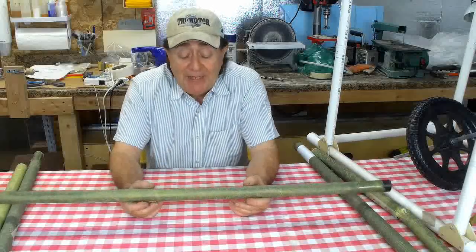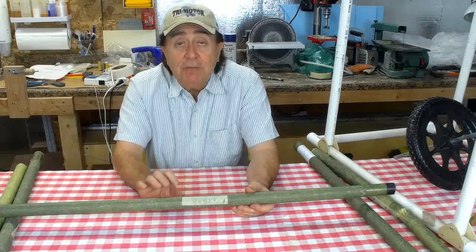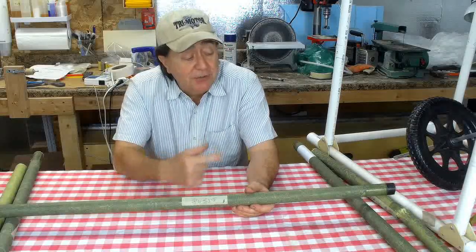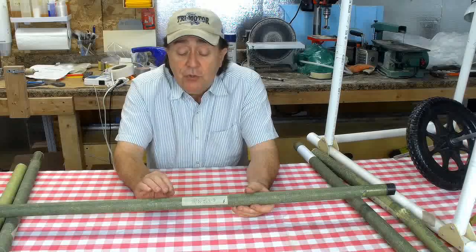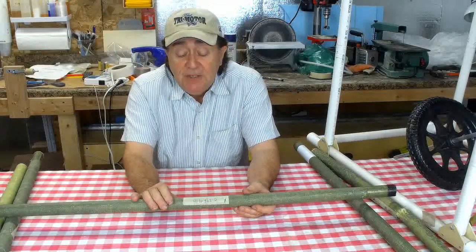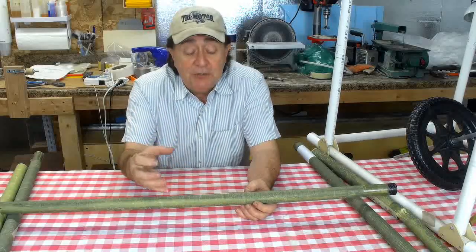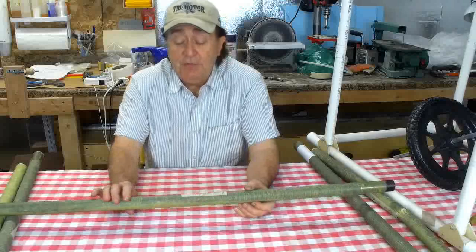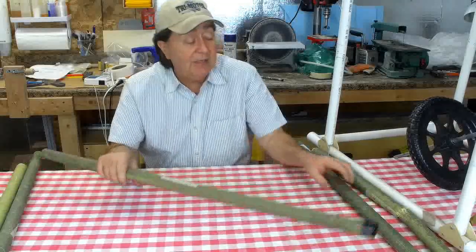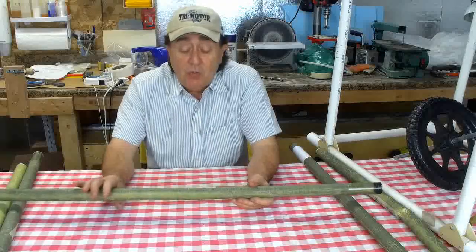Local buckling, bad. On the plus side, bidirectional cloth does not give off as many needle-like shards as unidirectional. So the 1 layer of Kevlar over the outside is sufficient for pilot protection. And thereby, by not having to interleave, I can make tubing that's lighter, and this is actually fewer layers. So it's really a lot lighter. You got 1.6 ounces over here, 0.89 over here, almost half the weight.